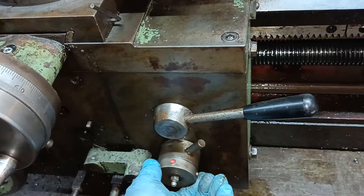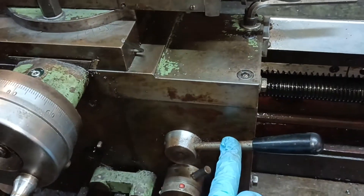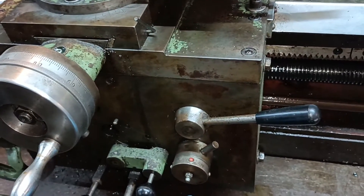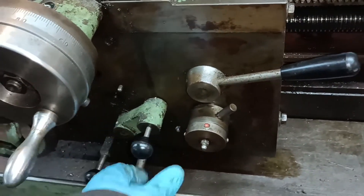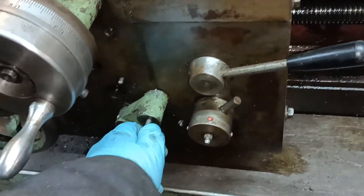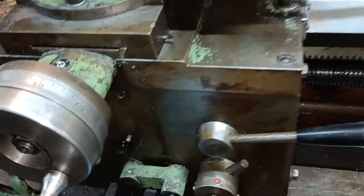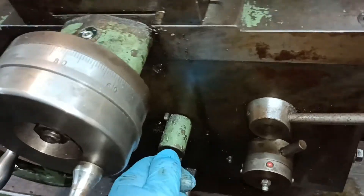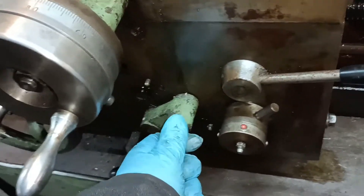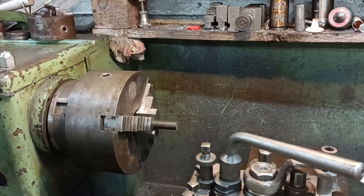This is the screw cutting dial indicator and this is the lever. Up is disengaged, down is engaged. You also need to have this lever — this piece — set in the middle like that, because that is for feed when you're feeding that way, and that is for feed when you're feeding the other way. You have to have both of those locked out and set in the middle. I'm going to do a little bit of turning first just to get that down to point five.